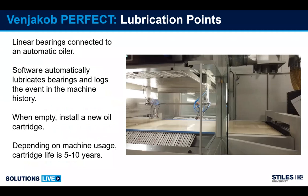Next, we're going to talk about lubrication points. This machine is equipped with an automatic oiler. The oiler has a cartridge of oil, which we're going to see. The software keeps track of how far the arm has traveled, and at a certain distance, it's going to throw up an alarm on the screen, in which an operator will push a button, and it automatically shoots oil. So this is kept in a log.